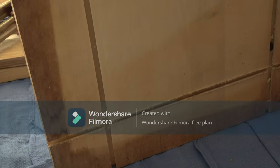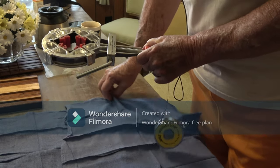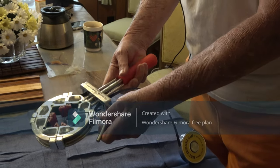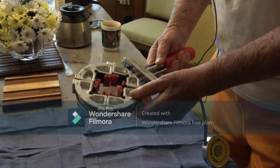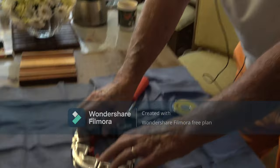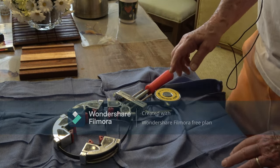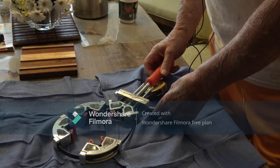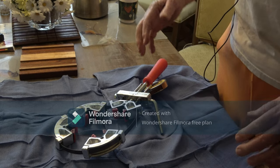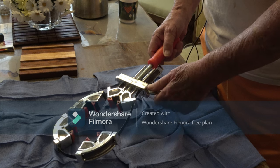Let's talk about a band clamp. This one I bought years ago. It's got a steel band — I don't know if you'd prefer that over a flexible fabric band, but it has a positive lock on it. You unlock it, spread out your band, lock it inside the four corners, and tighten it up to secure it. For putting picture frames together, door facings, or whatever, these really work well. That's another specialty clamp to add to your list.